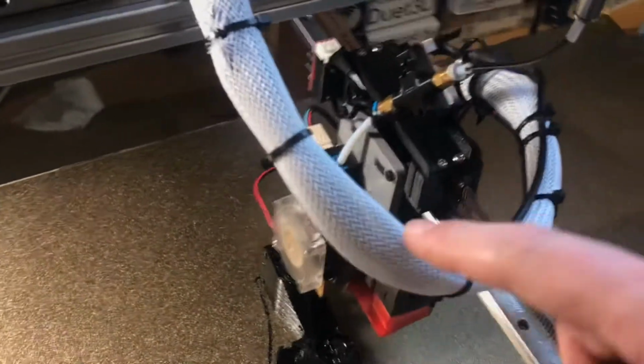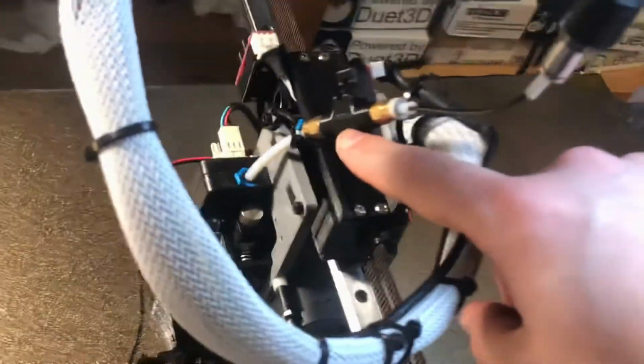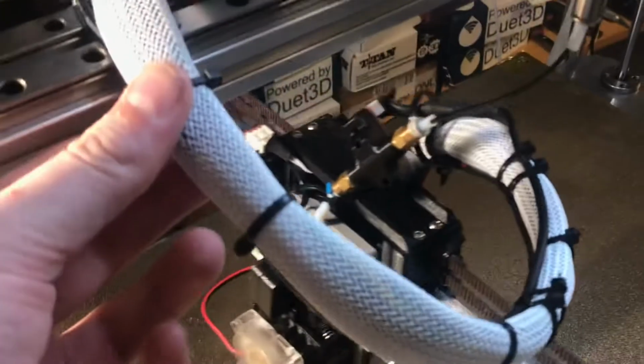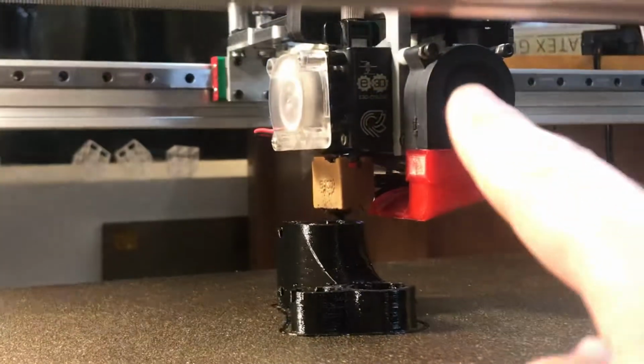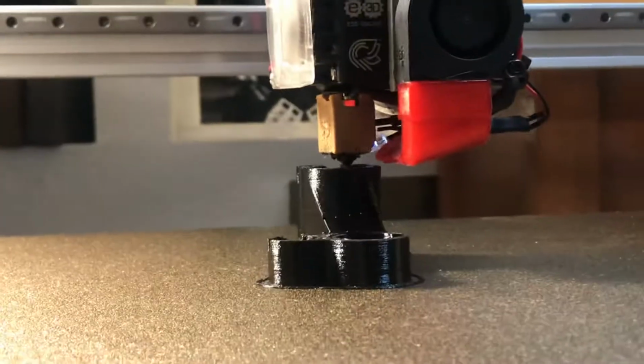Other things are the wiring loom here is shown featuring these zip ties, which will not be there, as the addition of our laser runout sensor was added on later, and we wanted to keep that down. And we also nicked this umbilical, but that will not be the case for any production units. The other things of difference are we may offer a few like this with the 4020 fan just for the size, but the 5015 that we have on our other printer, our other CoreXY option, a little bit smaller, and instead of being rectangular, it's square.